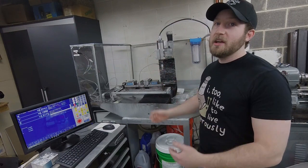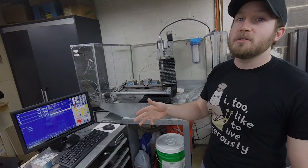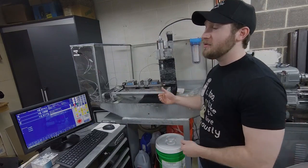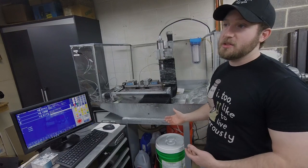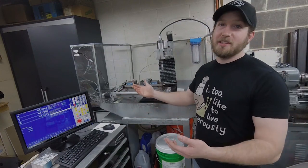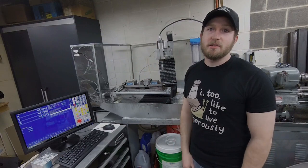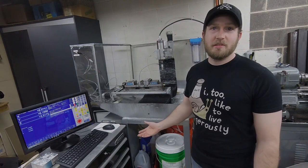I was at my wits' end and shot an email to a company called Centroid. I knew they made big industrial controllers for retrofitting machines like Haas and Mori Seiki — you could put a new controller on an older machine and keep it going, rather than deal with limited G-code line counts. I asked them what their big controller was and whether I could put it on this little machine.